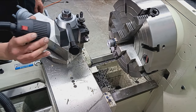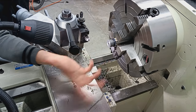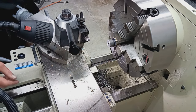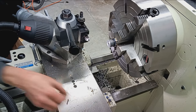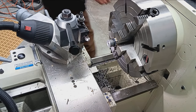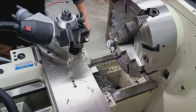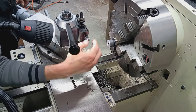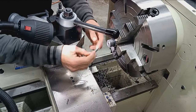Now we got to cut the cone. So these are Winchester 70s, Springfields, Enfields, and then there's a couple custom actions that kind of have a hybrid cone/flat breech. But this Winchester is a true cone breech, so we're gonna be okay.